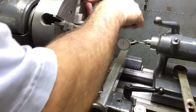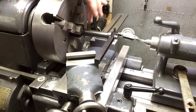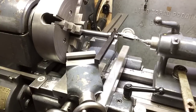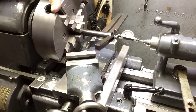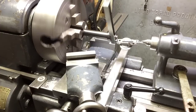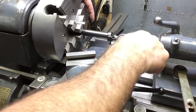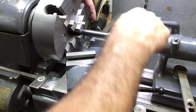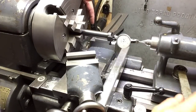But that's what I use it for on the lathe basically. If you had a really big piece, you could always chuck it up in a drill chuck and dial-indicate around on your face plate if you wanted to. But mostly what this is for on the lathe is indicating out your tailstock. I use a Morse taper number two ground center here, and I'm just going around it.